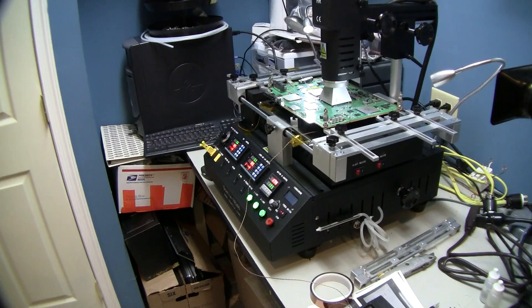Our bottom IR is pulsing — the plates are reading that they're up to temperature. Within the next couple of minutes we should get a max temperature on our preheat. The panels for the hot air are still sitting at the preheat stage, so once they start climbing we should notice a nice increase in component temperature. We put in a set of profiles — a slightly modified version of the HR-360 profile. This unit is very similar in size and shape to the HR-360 when you have the hot air unit on there.